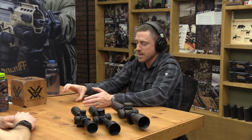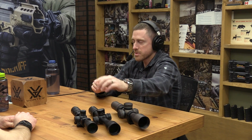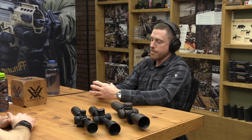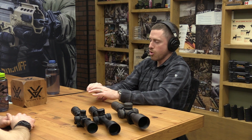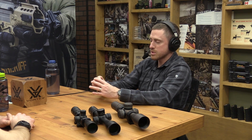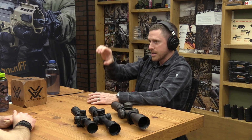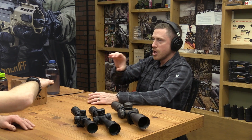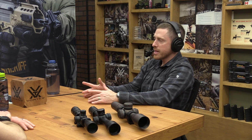Another thing is, they have to be really tight in that tube. People think, oh, you just have a really weak tube. No, they're fit so tightly in that tube, and it's so perfectly aligned to slide fore and aft. When you slide fore and aft, you don't want it also tilting or translating up in the y-axis or the x-axis. You want it to perfectly slide along that optical axis. So the tube is almost like a guide? Yeah, slightly.